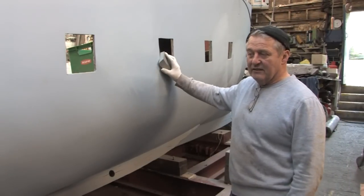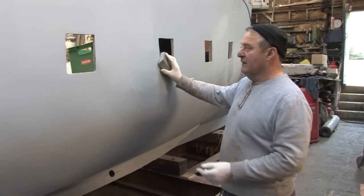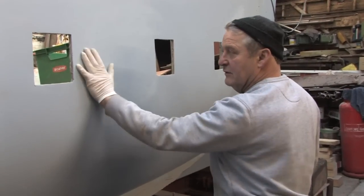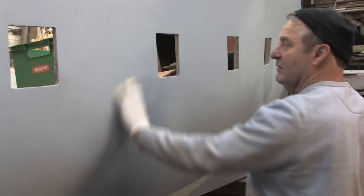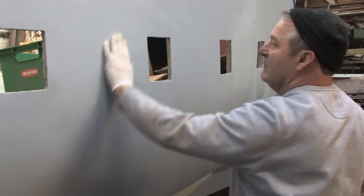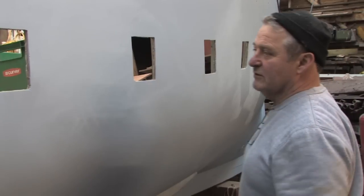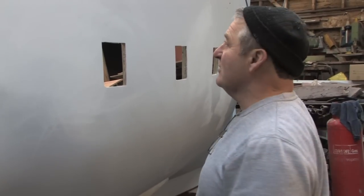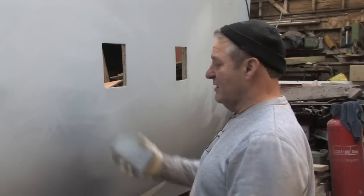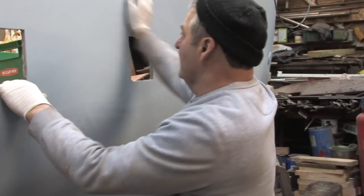Back around on the starboard side — this is the high side because the boat is still tilted over. This has now had a couple of coats of primer and an undercoat on the top. The first undercoat fixes on. We've got a nice finish on here, we can't see any of the nails. There might be a few tiny little blemishes that we can't get rid of but we don't want to take another eighth of an inch off the whole hull. So it's looking very, very good compared to what it was. The procedure now is we get these sanding pads and everything's just got to have a nice light rub over.